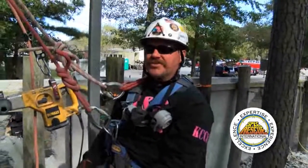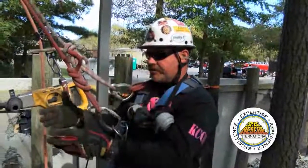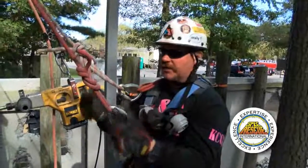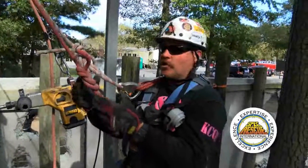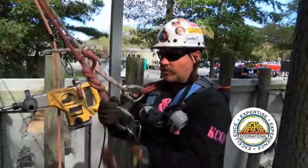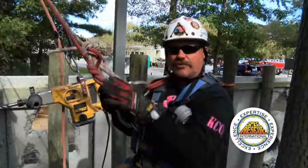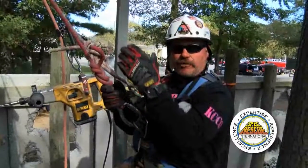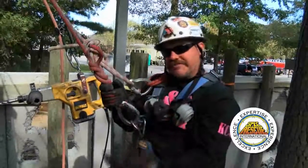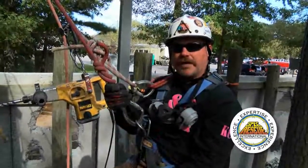The last thing I want to leave you with is it's hard to communicate when you have ear protection in and you're drilling, and you're trying to talk to somebody who's lowering you down. We found it easier to just have somebody lower you down rather than rappelling yourself. If you're using some sort of descent control device, it gets a little awkward as you're trying to drill, and if you're not in the right spot, they can raise you back up a little. That was just a few tips I thought I'd bring you today — I'm sure there are many more out there. For The Spec Show, I'm Mike Callagher.